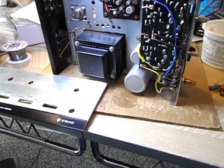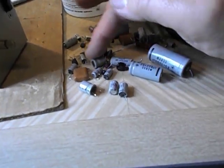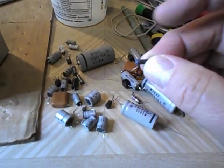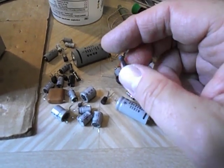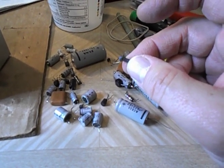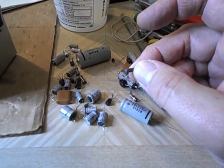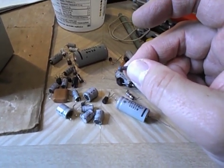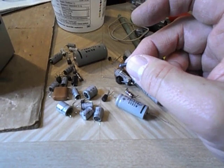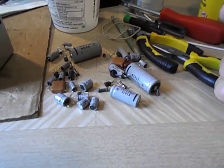There are a few little leakers — some of these oil-filled caps. This is everything I've replaced so far. The phono stage, once I got it working, I noticed it was very noisy. You see these kind of little tiny wire-wound resistors? These things are just inferior, and four of the 10 or so resistors on the equalization board are these. I think they were substituted at the factory — one's a 560K and one's a 15K in each channel. It's in the collector circuit of the first transistor, so you get a background noise even with new transistors. So I replaced those.